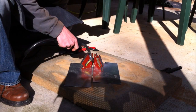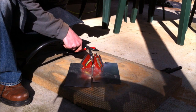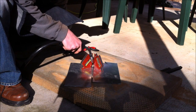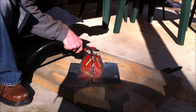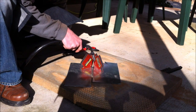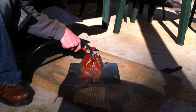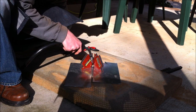The motion you want to make when welding is like you're drawing a continuous string of cursive E's. The travel speed corresponds to the thickness of the material and how much current you're working with, so always do a test piece first. A good rule of thumb is to travel at the rate of your material's thickness per second — so in this case, one-eighth of an inch per second — making small loops as you go to make sure you're covering both sides of the material.